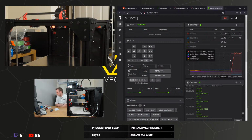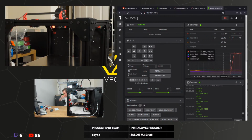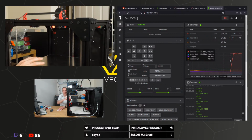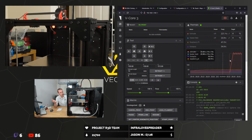I assume the LRS 200 PSU is okay. It's working well for me. It's a 250, but yep. That seems to be the universal printer power supply. The only reason you can use a low power one, I mean 250 is not that low, is that it's a mains power bed, so the 600 watts is not going through that power supply. Hence, you're only controlling motors, boards, and hot end fans and that kind of stuff with it. So your 250 watts should be plenty.